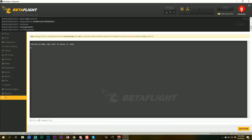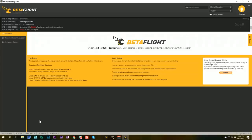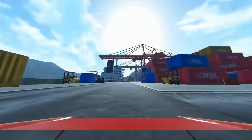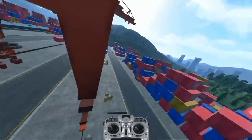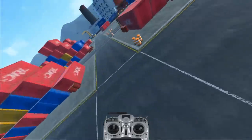Then you're going to connect to your flight controller, go to the CLI, and type: set usb_hid_cdc = on and save. What'll happen is you'll see a new USB game controller appear — in this case it's 'CL Racing F4' — that's a joystick and it's my flight controller. Then, after performing the same controller setup as you would in your simulator with any other transmitter, you're flying. I'm holding my Taranis in my hands, using my Crossfire receiver or FrSky receiver — whatever receiver you've got — and flying in the simulator.